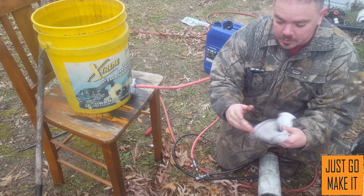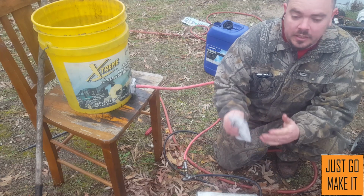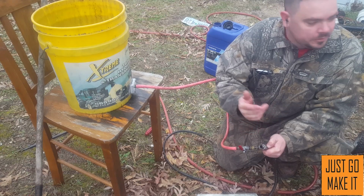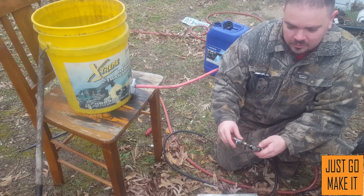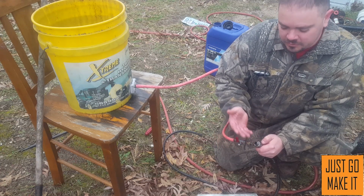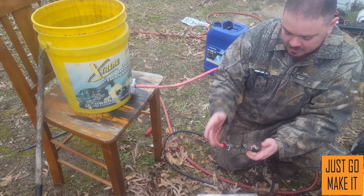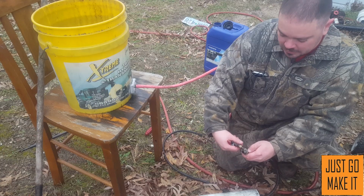And then having the burner backed up with the blower that I built, it actually gets very, very hot. Now I tested this outfit yesterday, and it actually worked really well. Now with the size of the tip I have, the MIG welder tip, my air compressor, which you can probably hear in the background running, barely keeps up with it. It runs about even. When it kicks on, it stays on, and it stays at a steady pressure. But MIG welder tips you can get in different sizes for different sizes of wire, and someplace I have some smaller tips with a smaller hole in them, and I need to try one of them to see if it works the same. But as a proof of concept, I am very happy with how it blows the oil into the foundry.